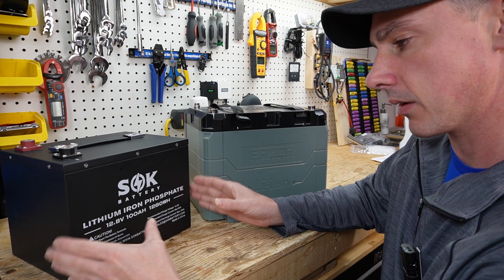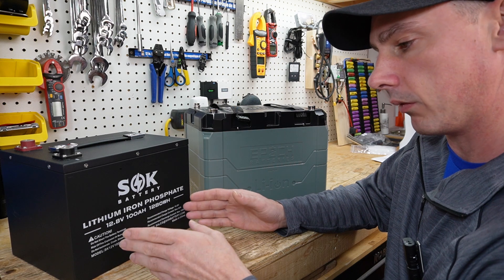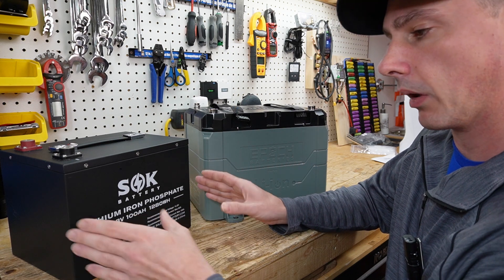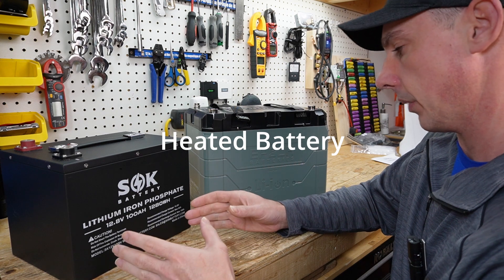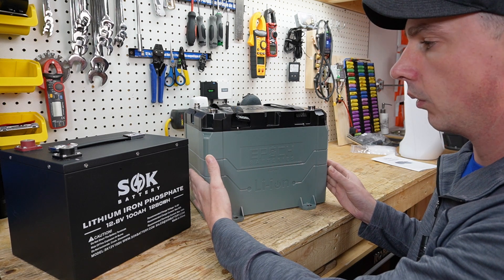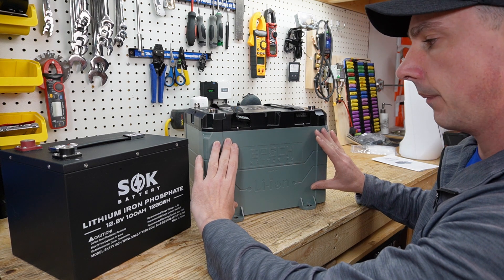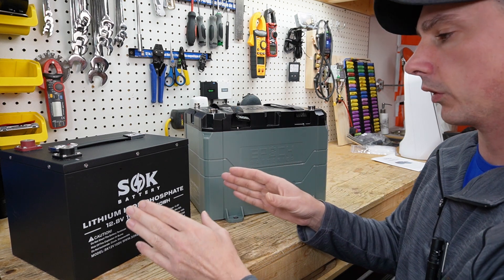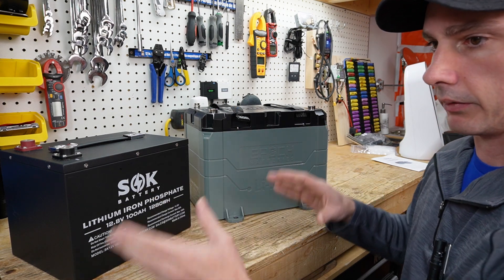What's amazing is that the SOK battery is in a metal enclosure and is designed very well. However, one downside is that you cannot series connect the SOK battery into a larger pack like a 24 volt or 48 volt — the BMS MOSFETs will not handle this, and the website also states that the SOK cannot be series connected. The Epoch, on the other hand, can be series connected up to 24 volt or 48 volt. They also sell the same engineered battery in 24 volt and 48 volt packs, so you can just buy the voltage you need or series them up.